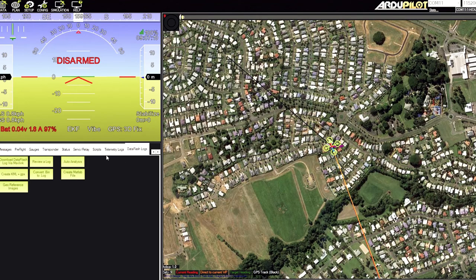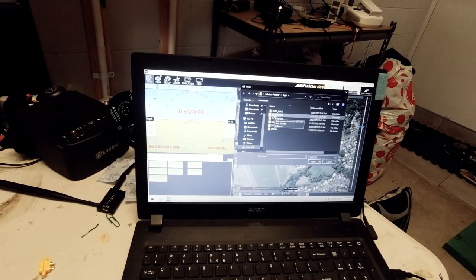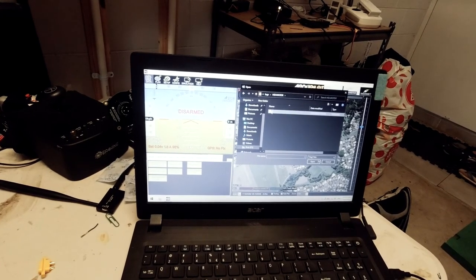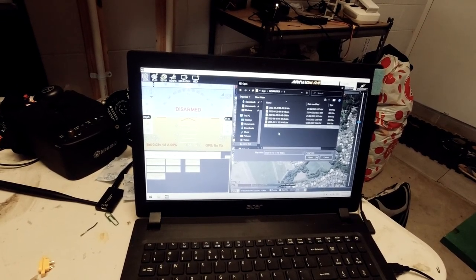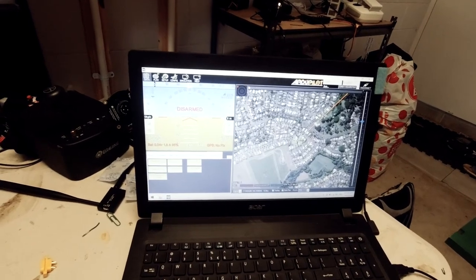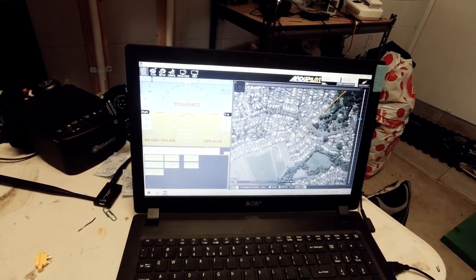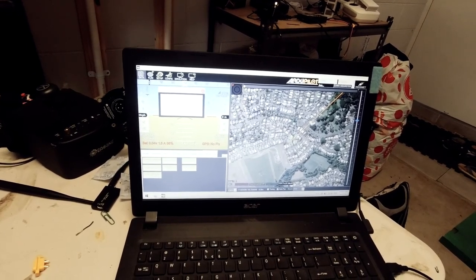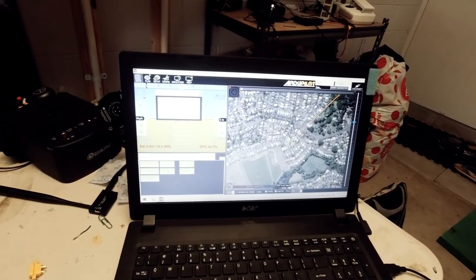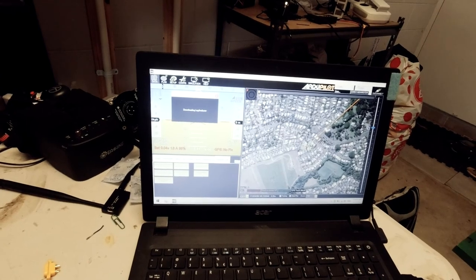And then what you'll do is go to auto analysis, and that'll open up the window it's downloaded it to. So select your craft, which is a hex rotor for me. This was the flight I did. So I'll show you that one. Click on that and click open. And what that's going to do now is analyze the flight. It'll tell me of any issues that I have. It'll tell me if the auto-tune is completed. And this is how I knew it wasn't completed when I first did it. So if you're unsure, you can always come into the log analyzer here and check it out.